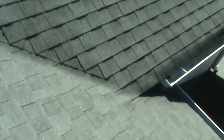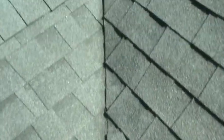But check out these valleys. I've never seen a house like this. Every single valley. This had to have been the builder's fix. Every single valley in this house is sealed with some sort of a sealant that you can see. This one was an asphalt sealant. See all the cracks in it? Asphalt in the Atlanta market is a 3-month fix. That's it. Nothing more. So it's really too bad, because if this roof had been done right, we wouldn't be talking about a new roof.